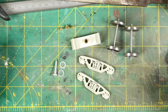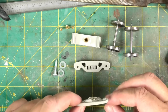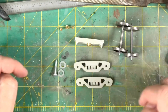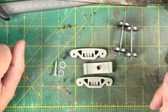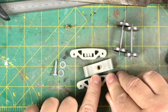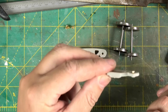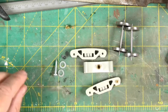This is our bogey assembly. It's quite simple: insert the bearings into the bogey frames, which I've already cleaned up — removed all of the flashing — and glue the bolster in the slot. It goes in this way up. It's quite a simple little design: three pieces, two wheels. No compensation, but then it's a narrow tiny short wheelbase. So the first thing is to put the bearings in the bogeys, which is quite simple — that goes in there like that, a gentle tap with the hammer.